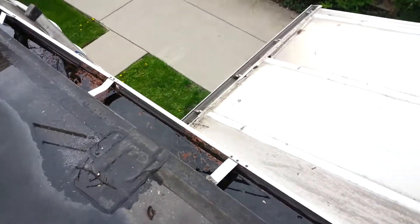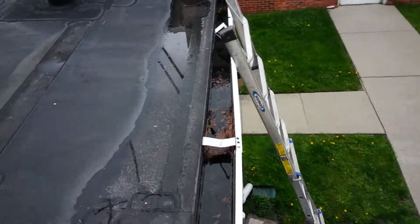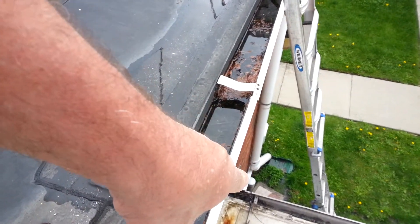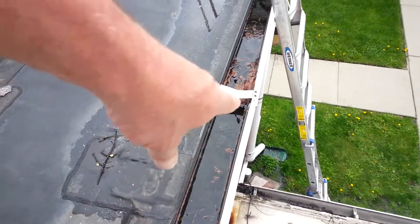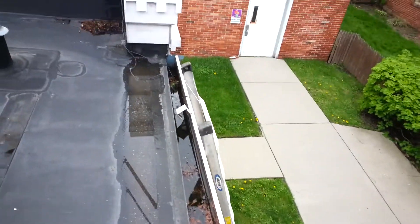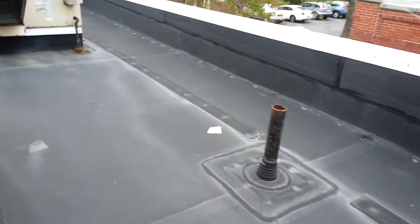So that would take care of their leaking coming in from the ground traveling, but we also need to see the drain tile down here. You can see where the pipe is out of the drain tile — there's a riser there. That has to be camera'd and snaked to see where it goes. If it goes good, that pipe needs to go into it along with all the gutters. So we're going to give an option to snake these tiles out, camera them, and report.